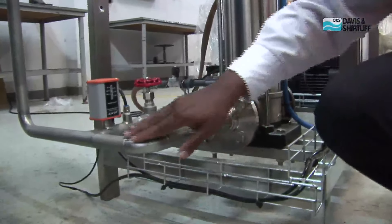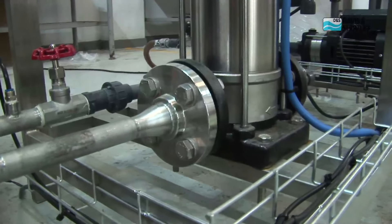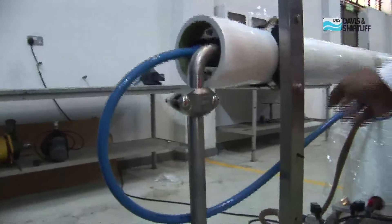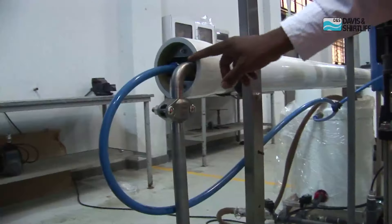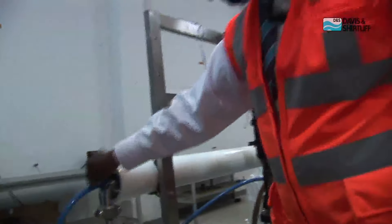From this point, we have a stainless steel inlet. This stainless steel is used to handle the high pressure and even the high salinity of the water. From this point, this is where you have the water inlet and then we have the separation taking place. These small membranes — these are the four-inch membranes. For bigger systems, we're going to have larger types of membranes. So the water gets separated all the way to the end, and then we get the permeate water from the blue line.